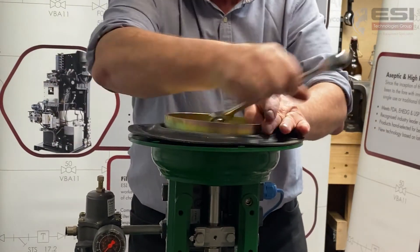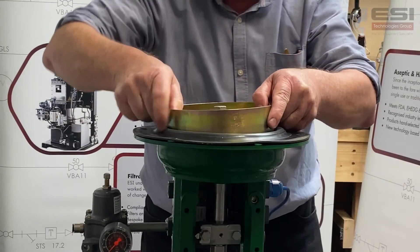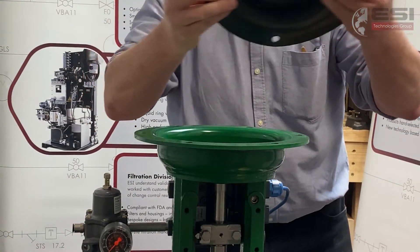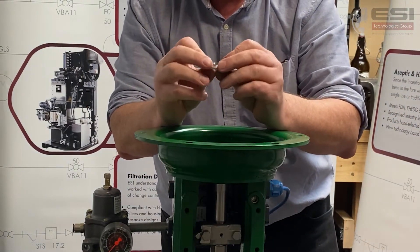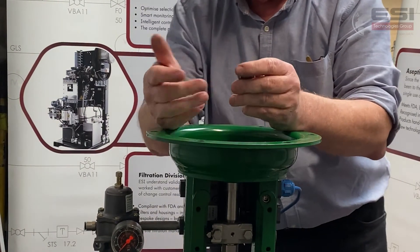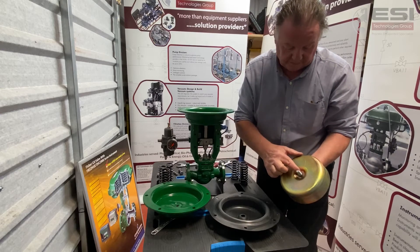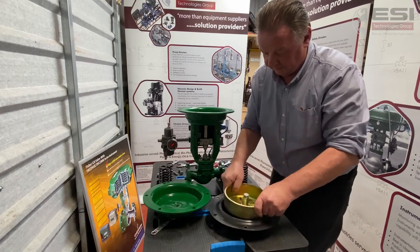We take this off and remove the diaphragm. Here's our diaphragm, and underneath it we have a guide that locks into the diaphragm and seals it from the atmospheric side. Also on the diaphragm plate there is an O-ring on the bolt — we'll have to move that over to the other side as well when reassembling.